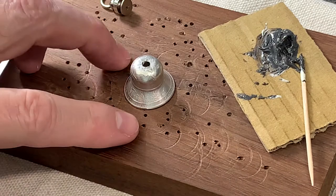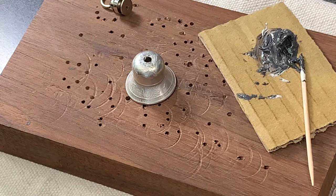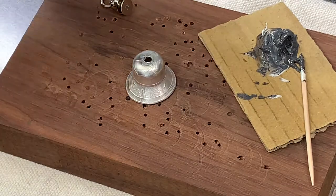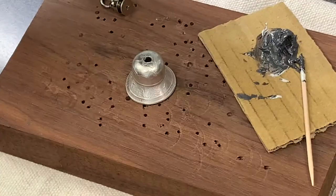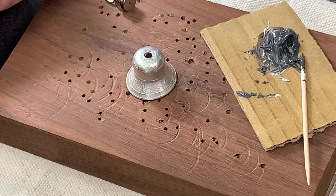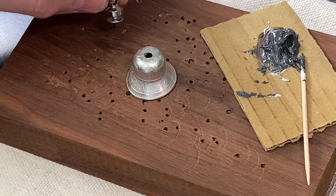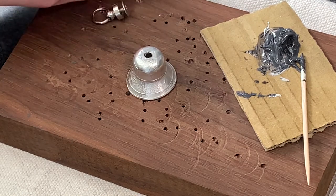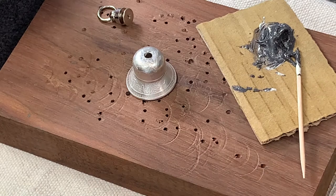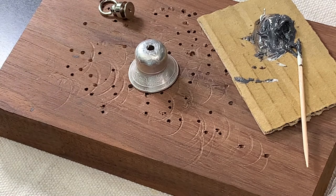That's really all you need to do. You lay it aside, wait a couple of hours. I'm going to come back when I know it's set pretty good - four hours and it's really set. Then take a plastic clamp and just clamp it together and let it sit overnight. After that we're ready to add a clapper. There's a wire we put onto our topper that attaches to the clapper - that's our next segment. At the very end we'll probably do some antiquing with Black Max. That's how we bond our two pieces together using JB Weld.